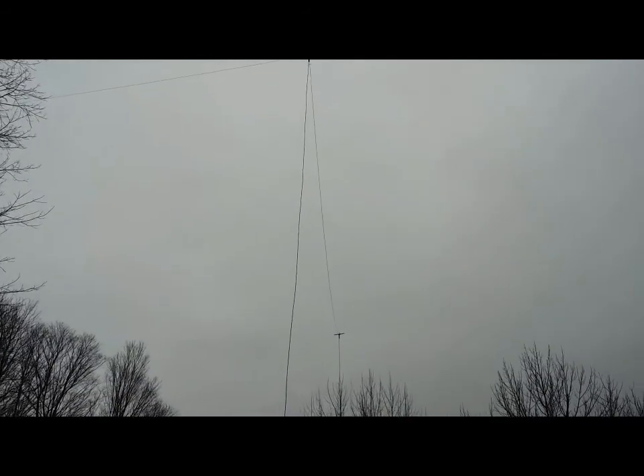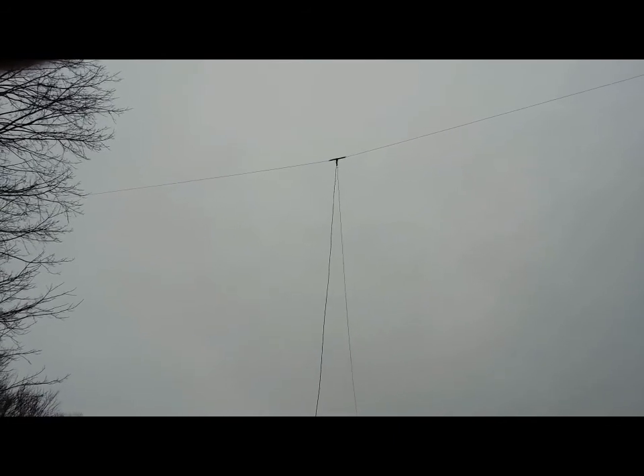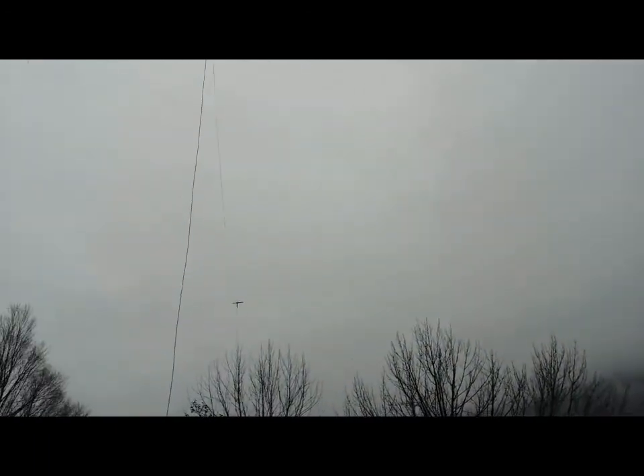This is plenty adequate — I run a kilowatt through the other systems here and never have an issue. So let's go out to the antenna itself. We've got two equal-length dipoles cut for resonance at 3.70 MHz — that's the DX portion. I'm planning on upgrading to Extra. There's the southeast corner of the array. They're spaced about 40 feet right now and I just can't sneak it out any further.